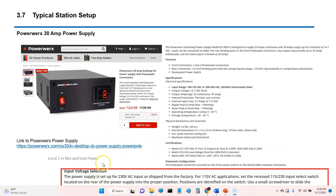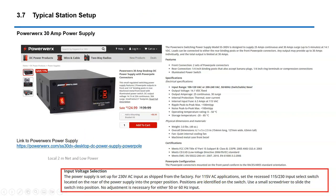This is my power supply. One thing to note: when you purchase this power supply, it comes configured for 230 volts, so you have to take a jumper and convert it to 115 volts. It uses Anderson Power Pole connectors, which is just great — really good, thick fit. And those are the Anderson Power Poles right there.